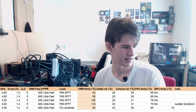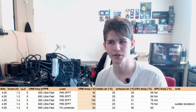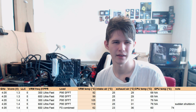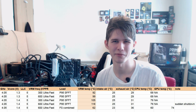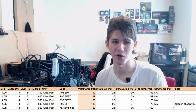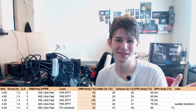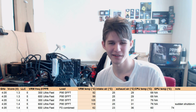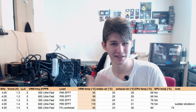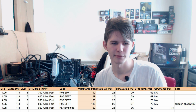Yeah, that's kind of that. If you're on a 2600X, then knock yourself out. It won't give you any issues at all. But if you're on a 2700X, then it might have some problems. Though I will point out that if you have a 2700X, you probably shouldn't be manually overclocking anyway, which I mentioned before. You should just crank up the performance boost override and not touch anything. That's the easiest way to do it, and it gives you very easy performance. It does decently on the thermals. It doesn't go to 1.4 volts at all core load. It doesn't really clock that high, but it works well enough.